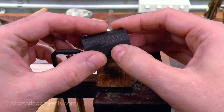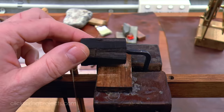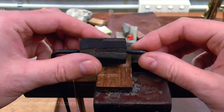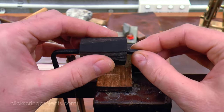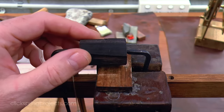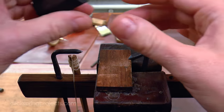A key feature of the lathe is that the two prongs are lightly sprung when a workpiece is loaded in between, providing the closing force that holds it in place. It's convenient to load and then unload the lathe. A small twist and the work pops out. Reverse the move and it's back in place again. If the workpiece is a little too long or short for the prong spacing, the next hole along can be used, and at any position, the prongs can be slightly bent in or out to modify the closing force.